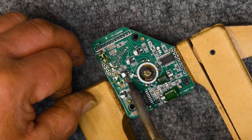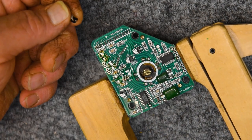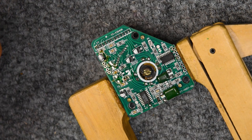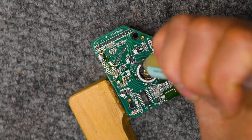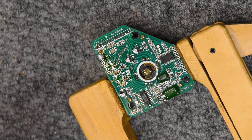It stays liquid for a much longer period of time than the standard solder, and so you can just work back and forth, and it'll eventually get underneath the pad, and it'll just allow you to remove it easily. Of course, it's meant mostly for ICs, but it works on these too. But again, the difference being the heating cycle time on that is quite long.